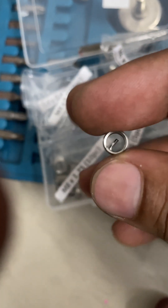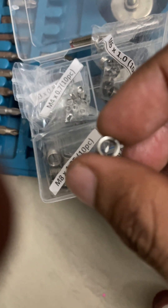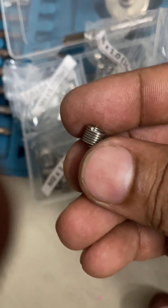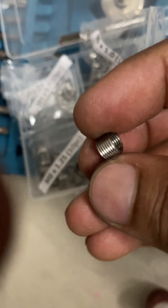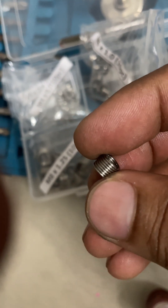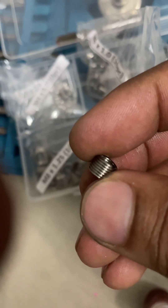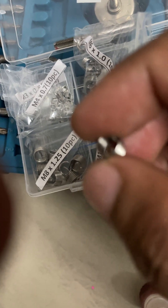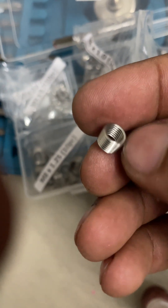One thing you need to be very careful of is cranking. Once you start cranking it, get it done with — you will not be able to pull it back out because that tang will break. Pulling it out is not easy. One or two threads it will still come out, but if you go in any more than three threads deep, this thing is going to take a lot of force to pull out, sometimes damaging the new threads you've made.